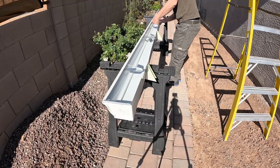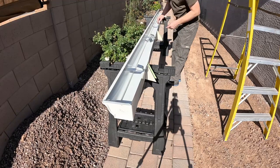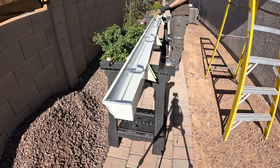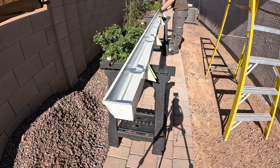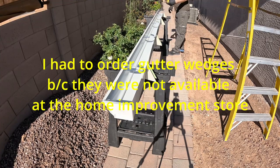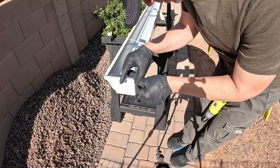You can see I have wedges also on these gutters. Now these wedges will make it so that the gutters line up at a 90 degree angle once they're held on next to the fascia. I will have to trim these gutter wedges down — I'm just placing them on there before I put my first piece up to the house so I can eyeball what kind of cuts I need to put into those gutter wedges.